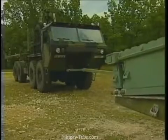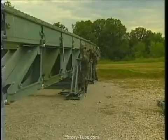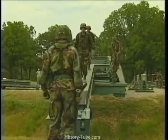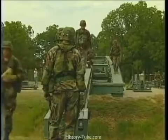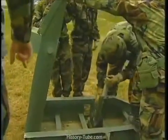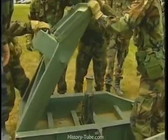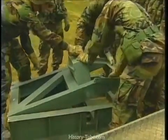A crew member drives the truck that pushes the bridge toward the far shore. The far bank crew crosses the bridge, where they'll begin setting up the landing roller pedestal. Place the full extended jack on the tilting platform in the base of the landing roller pedestal. Remember to practice extra caution when aligning the landing roller pedestal.